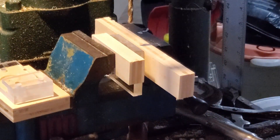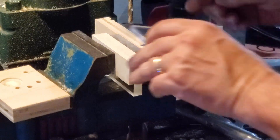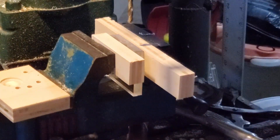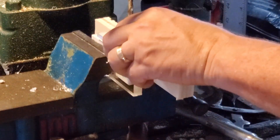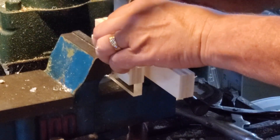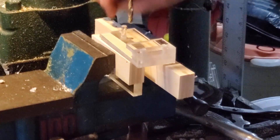I have to line up that hole because I can't do both at the same time. I'm going to put this on, drive in that peg to hold the whole thing in position so the holes will line up. I'm driving the peg in just far enough so I have a feel for where it's sitting in the hole. I don't want to pound too hard on that assembly — it moved a little before and I don't want to make a mistake this far into the project.